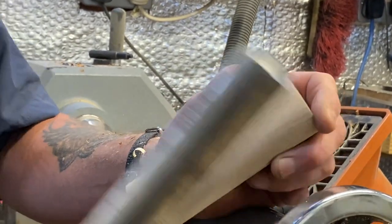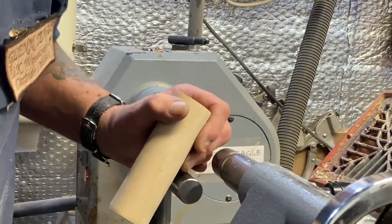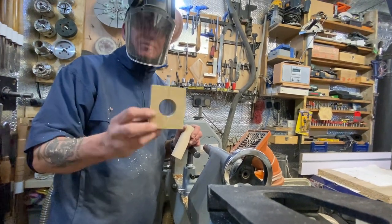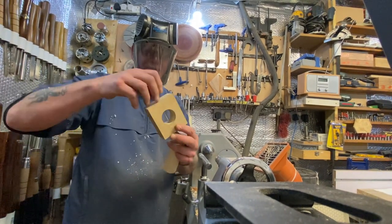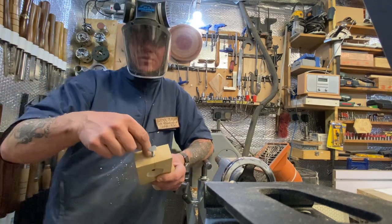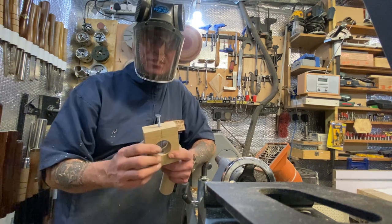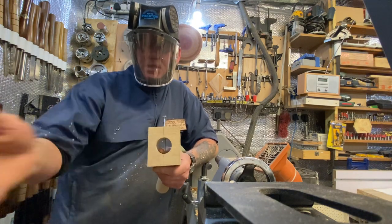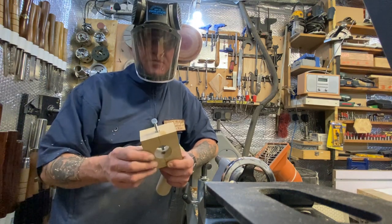And you just saw, I just sharpened that on the lathe with that. Okay, that's absurd, isn't it? That cost nothing, it's scrap. It cost me a bolt and a thread. That's it. Just drill your hole, get it centered, and put one of those threaded inserts in and you bolt through. That's it. It's not a forever fix. Although, if you can get one made up out of metal, I've made mine, I've had mine for 8 years now. Still going perfect. Okay.